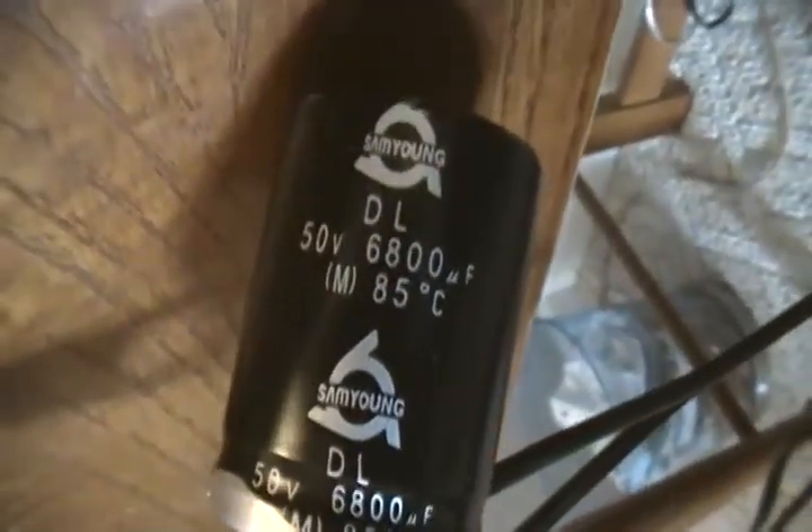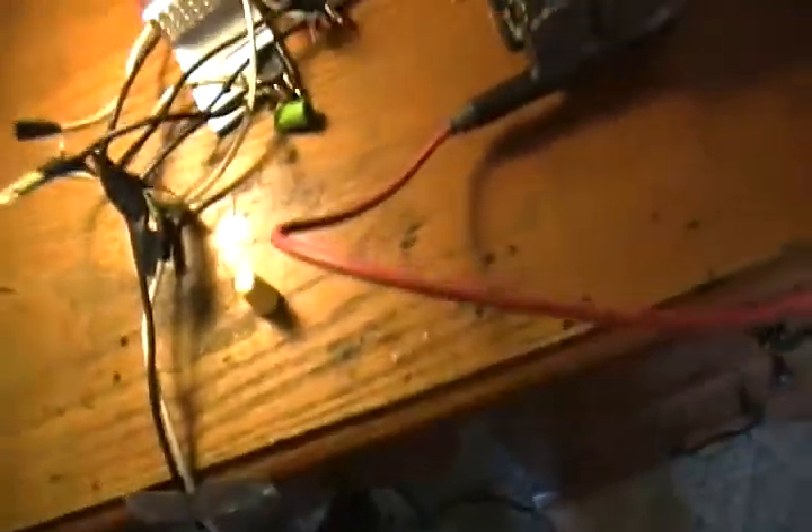Other than the transformer, I also got these really nice capacitors right here — 50 volts, 6800 microfarads. It's perfect for this circuit. Now since I have 50-volt caps instead of 35s, I can get all the way up to 40 volts, until I modify my ZVS for more power.